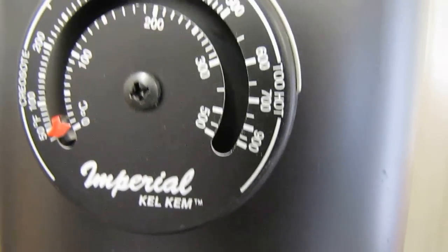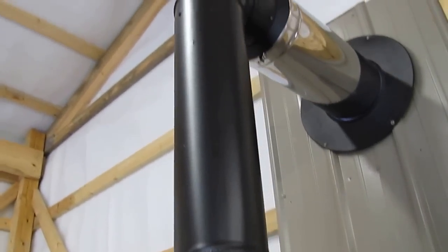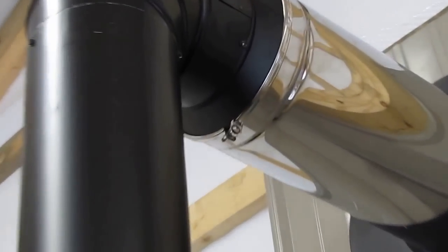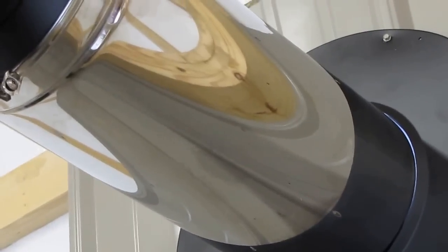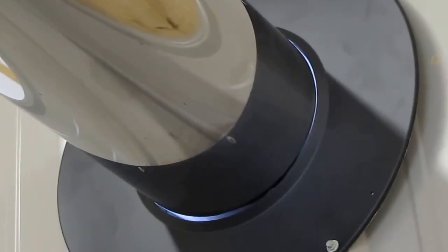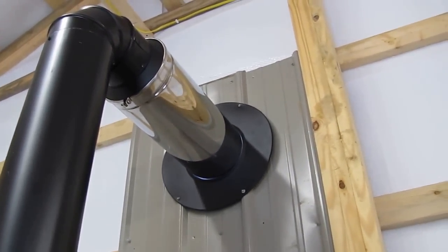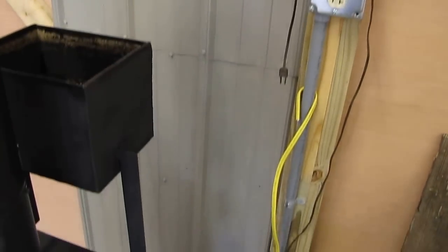And this is the support that started it up, all that good stuff. And here is our stack install. We use self-locking stainless steel collars and everything. And that is class A double wall super vent pipe going through the wall. And also, we use the heat shield from leftover material we have from the building, which is going the entire back of the building itself.